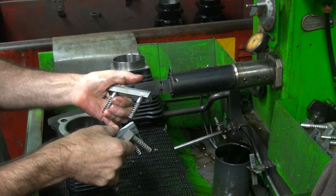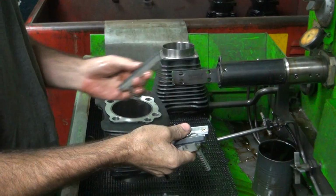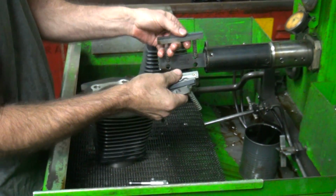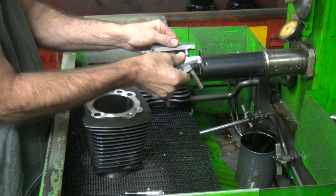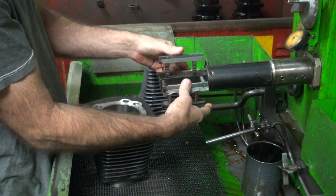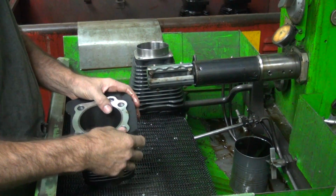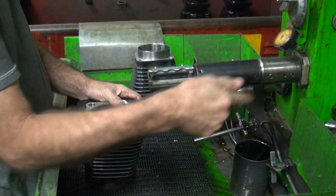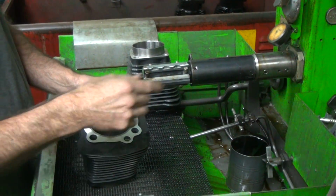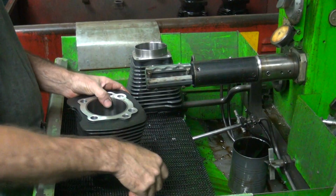Okay, this is our 300 stone, which is about, I forget what it is, about 180 or 220 grit. I forget which one it is. 300 does not mean 300 grit. And this one I hone to, on the fine stone I use, I leave 0.5 thou. The next one down I leave 1 thou. And then this one here I leave 1.5 thou and I go to a real coarse one.